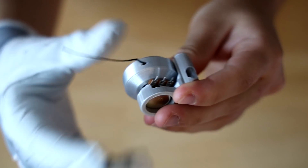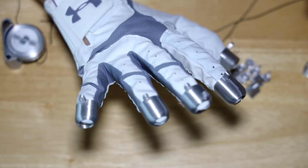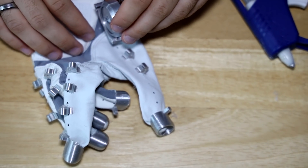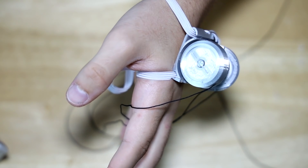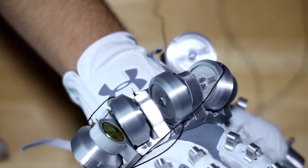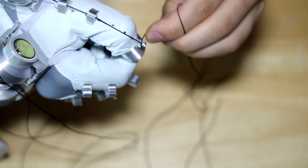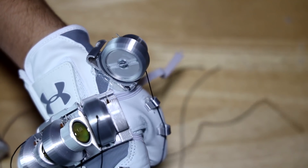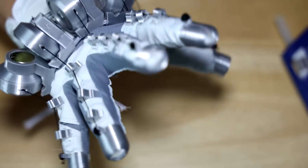Now that we have our reels ready, let's put the glove together. The potentiometer backs from the reels should snap right into the printed holders. Put an end cap on each finger making sure it's sized correctly, then glue two or three guide nodes onto the back of each finger using hot glue. You can glue the badge holders onto the glove or attach them with elastic using the included holes. Feed the string through the guide nodes by snapping it through the slits, then attach the string to the end caps by tying a knot or wrapping it around. When you open and close your fingers, the spools should rotate responsively.